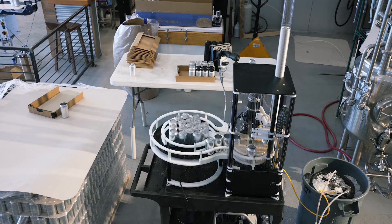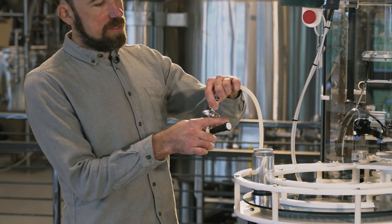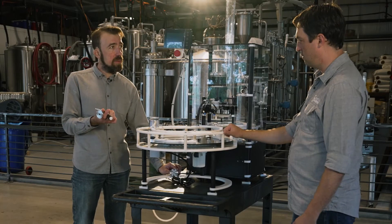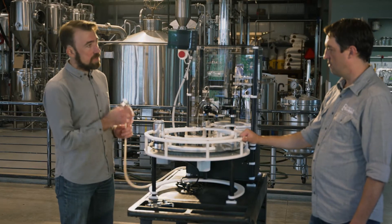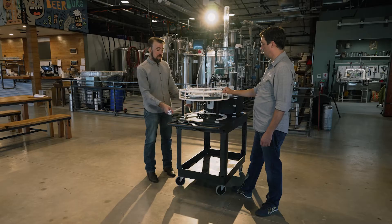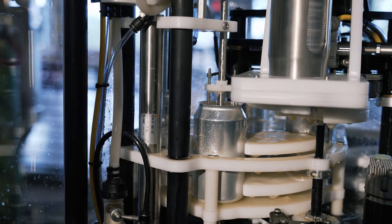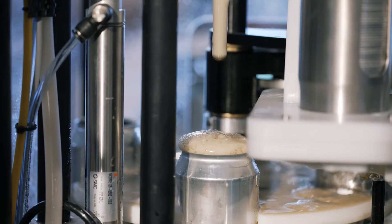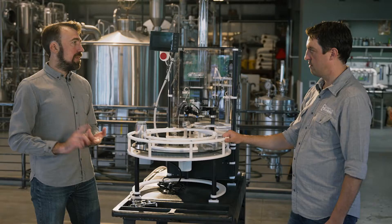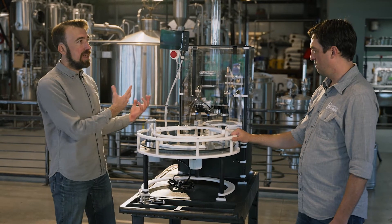It really does work well off of pretty much anything. You can run this directly off of a keg using a basic Sankey coupler and a tri-clamp adapter. This is part of the clean-in-place kit, or CIP kit, that we offer with this machine. You can also connect directly to a bright tank — all connections are inch-and-a-half tri-clamp industry standard. The machine also requires a CO2 connection which powers the purge operation and pressurizes the keg or bright tank, plus a pneumatic air supply to operate all the pneumatic actuators.